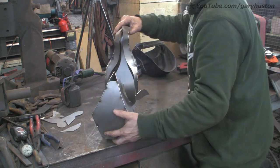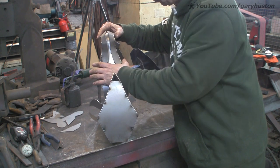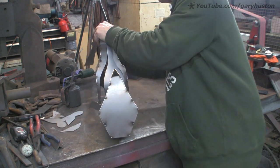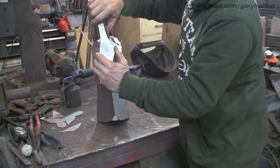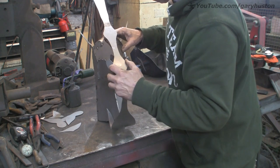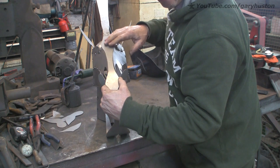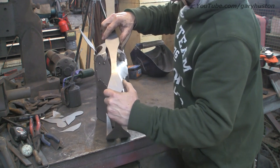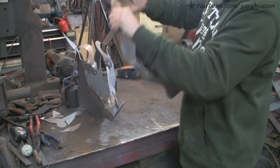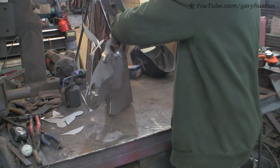Because where it's thin there it's really easy to bend with your fingers. One of the hardest parts is holding this damn thing still. As you can see there it's sort of about right, but it's not quite right there. We're going to be right around here by the nose - that's going to be a little bit harder to bend. But what I'm trying to do is just sort of find where there are positive points that you can't mistake, like at the end of the nostril there or the top of the nostril, where it's got to go. And then you can put a little chalk mark or a pencil mark or a sharpie mark and then just give it a bit of a tweak and keep trying it - that's all I'm doing.